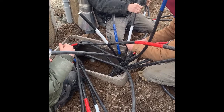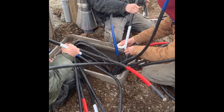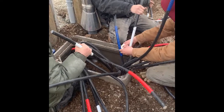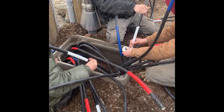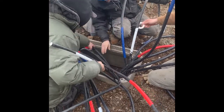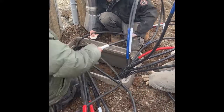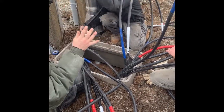Here's my boys sorting through the mess of wires — we're just getting ready to do the splices, making sure the phases are correct. We have two four-inch pipes coming in and coming out, there are eight wires altogether, so there's actually eight splices — sixteen wires if you count the ones going out.